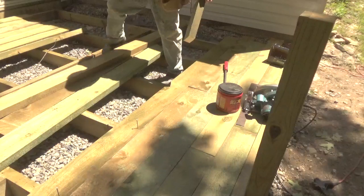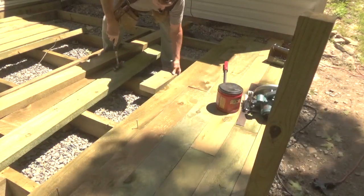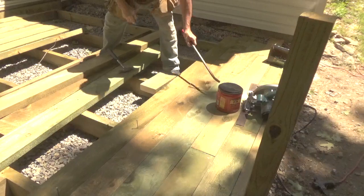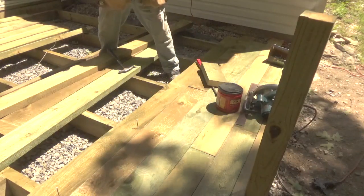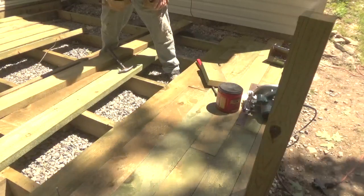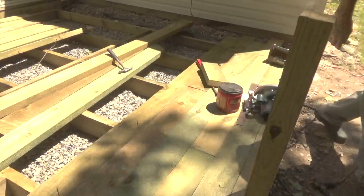What you could do is possibly nail a board down, leave the head stick up so you can get at them, okay? And then maybe a bigger pry bar to pry that. And if things really get drastic for you, what you want to do then is get yourself a 2 foot long board that's going to go from one rafter to the other, or one joist to the other. Okay, let me grab a board here and I'll give you an example of this.